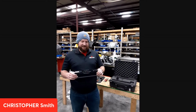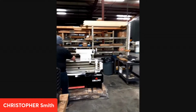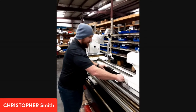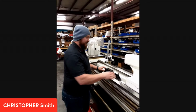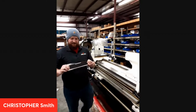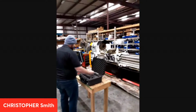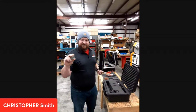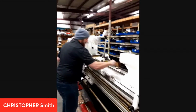You just move hairs. And the biggest thing with these, you want to constantly be wiping off the surface that it's going to contact. You also always want to rub it into the surface. What you'll see me do when I set it down, I'm going to rub it back and forth, get those two surfaces to mate real well. And then I'm going to slowly adjust, get my side to side first, and then my up and down. You have some machine blocks, Chris, that go across the bedways to get that? Exactly. Another tool you're going to need, you can order online, machining blocks that are specially machined to the exact same size. That way, to get over the V-way on your bed. And again, same thing with those.